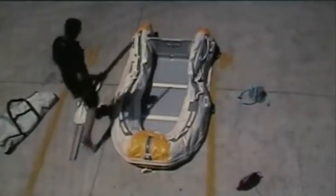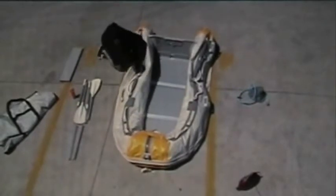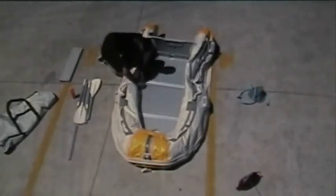It's a good idea if you can find a small piece of 2-inch by 1-inch or 50 by 25 timber, stick under the boards at this point to lift them off the ground. It makes it easy to get these rails in, which can be a little bit tricky otherwise.